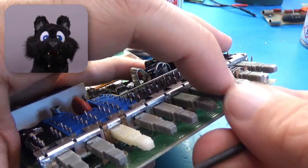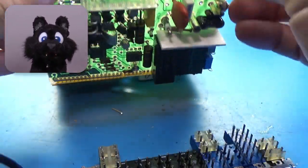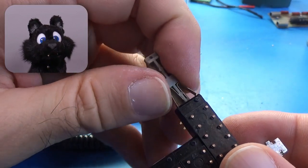The selection switches are ganged up in two banks — mode and range. I had to desolder the block to disassemble them and clean the insides with a Q-tip.